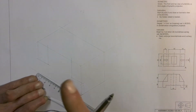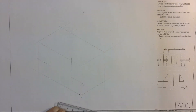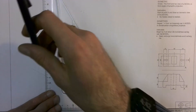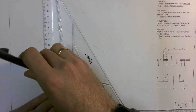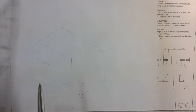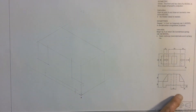So we're going to take that 13mm and mark it off on both sides because those little legs are the same on both sides. Then we know it's 5mm up — we can see that over here. So we're going to draw in a little construction line, mark off the 5mm, project that across, and draw our other little line up, which will then meet up with that. So that's our little bottom hole over there.